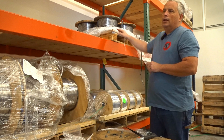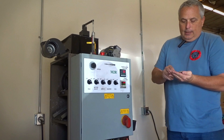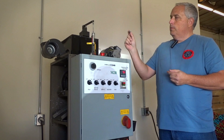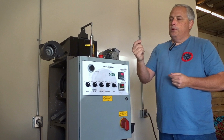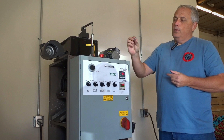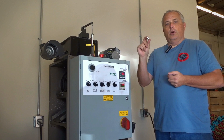As we increase what calibers we're putting on our high-speed machine, we have to buy new lead wire for all those different calibers. This is our casting machine. The machine takes cold lead, melts it — right now we've got it set at 782 degrees — and this is going to turn the molten lead into blanks that we use to make bullets. This is what we use to make our 290 grain .45 caliber. Basically it pours into a mold, it solidifies, cools, and it has cut sprues on one side and finished blanks on the other. Once these cool, this is what we put into our Corbin swage machine and turn into a bullet.